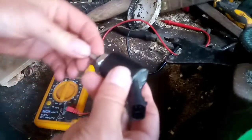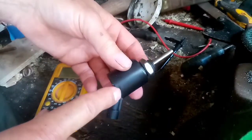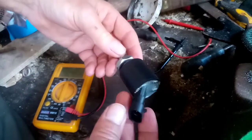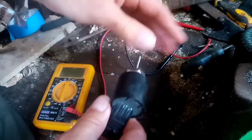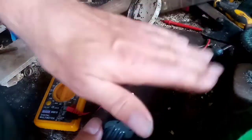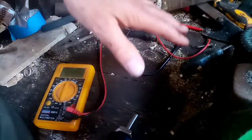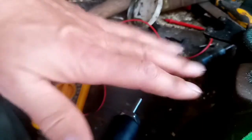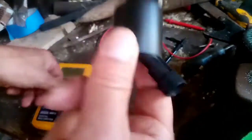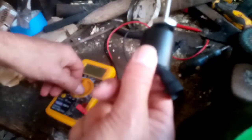This is the potentiometer that I took out of the combine. It does the sensing fingers on the bottom of the table and also the level for the auto-level, so it knows where the plate is on the front. You've got three of these - one at either end of the actual cutting table and then one on the plate that moves the table from side to side. I've put three new ones in; one had broken and the others would appear to have something wrong with them.